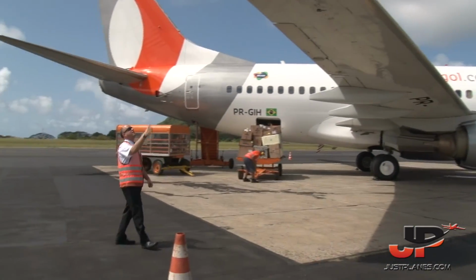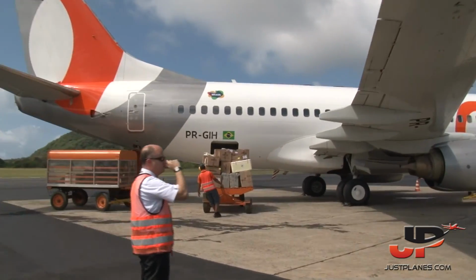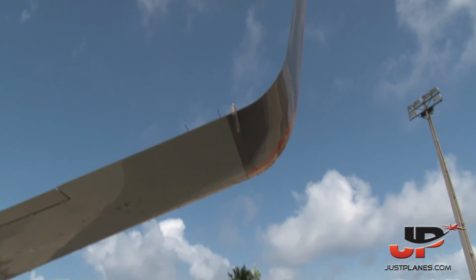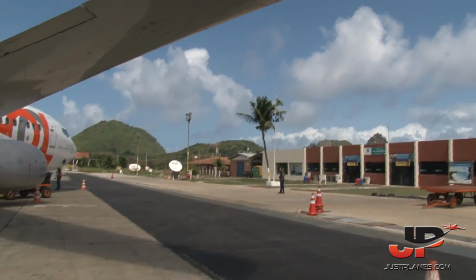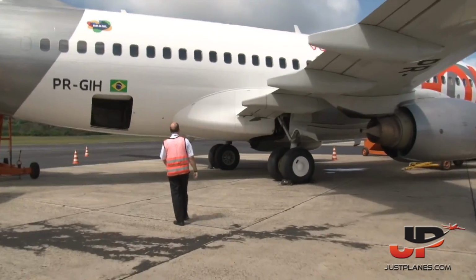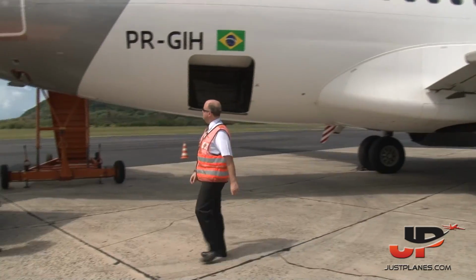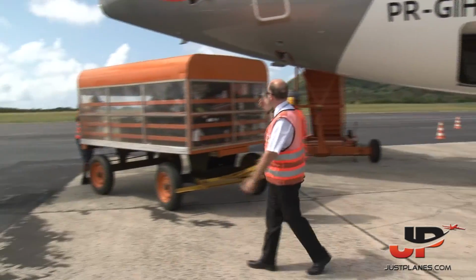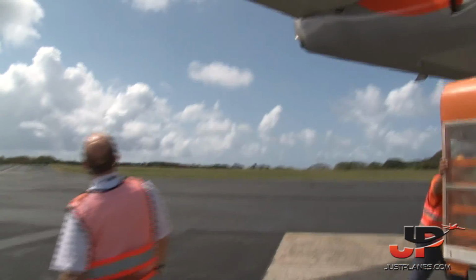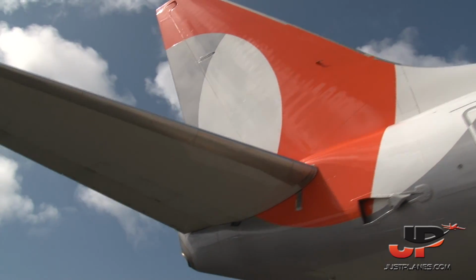On the back part of the winglet, we can see there's this discharge, electrical discharge. It's important to be there, otherwise you're going to lose radio contact during the flight. We're still looking at the trailing edge, the aileron, and the trailing flap. So just keep walking and looking into the inlet of the APU, the horizontal stabilizer, the rudder, air conditioned. Again, very important to check the discharges.